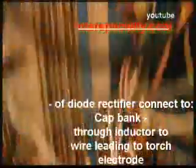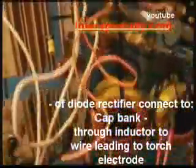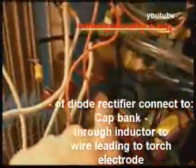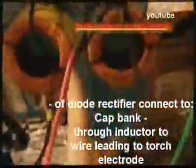For the negative connection from the diodes, you will connect a high-voltage capacitor between the positive and negative, which will suppress high-voltage spikes. Your negative line then goes out and connects to the negative side of your capacitor bank. Another connection runs through series inductors — all four of these in my case give me a single inductance because they're all hooked together.